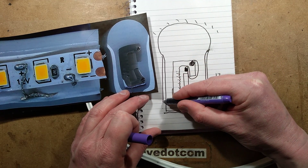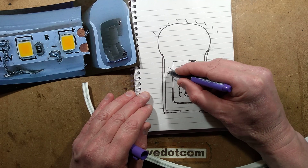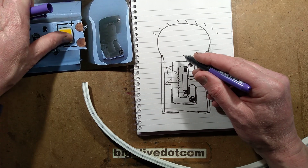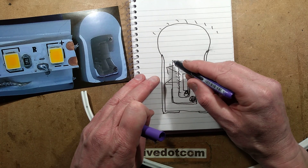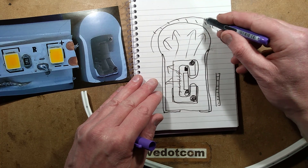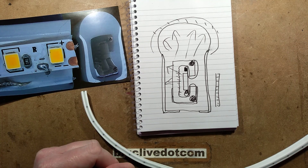In operation you can't see the LEDs directly because they're shining out onto this surface — it bounces off that surface and it's a diffused material that has the appearance of silicone sealant. The light diffuses out and ultimately spreads out into the front. Because you're not viewing LEDs directly it gives that linear glow around the whole thing. It's not very efficient, but it produces a very good visual effect, and that's ultimately all they're looking for.